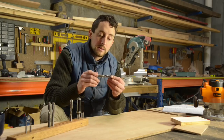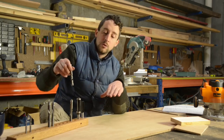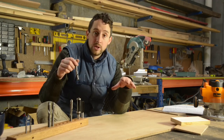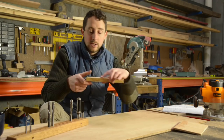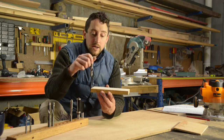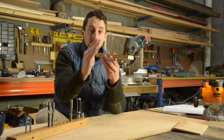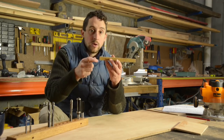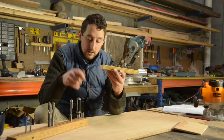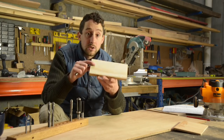The final thing that these bits do really well — and this applies to both up cut and down cut — is if you're following a pattern around, maybe a circle or something where you're going to have access to some grain where you'll be cutting against the grain, which has a tendency for high tear out. Because the blade isn't hitting the grain in a way that wants to pull it away — it's actually slicing through it — it allows you to do more complex shapes than you could with a standard straight bit without having to flip the timber over to follow the grain direction.